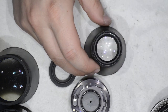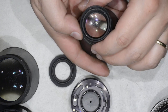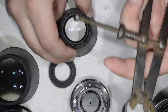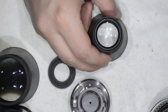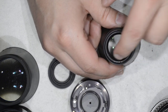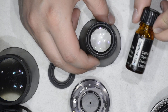Here we reach the part where we have the mass of the fungus. For the last retainer ring you can use a spanner key — I like to use a mason's compass. Once again there is a bit of glue; this lens has glue everywhere, and you have this shiny residue which is glue that you need to remove.